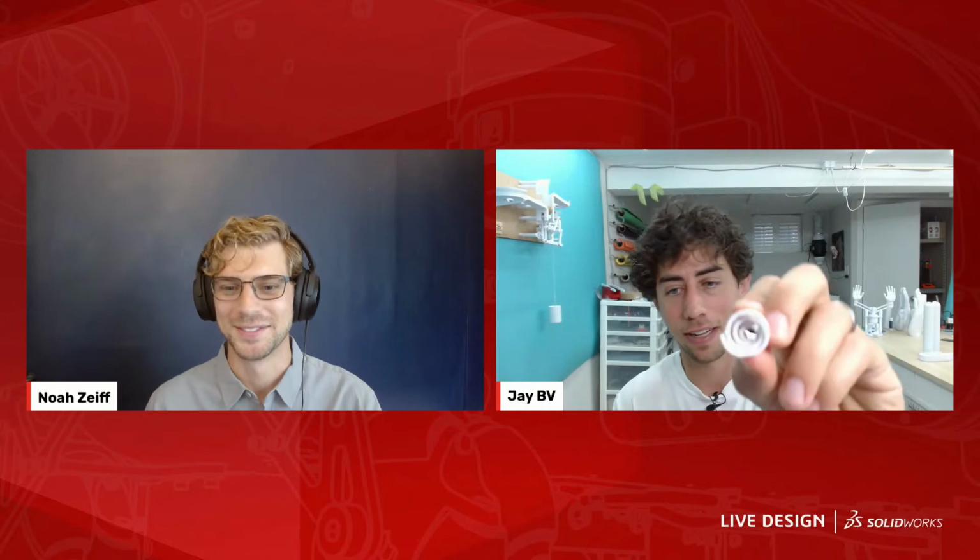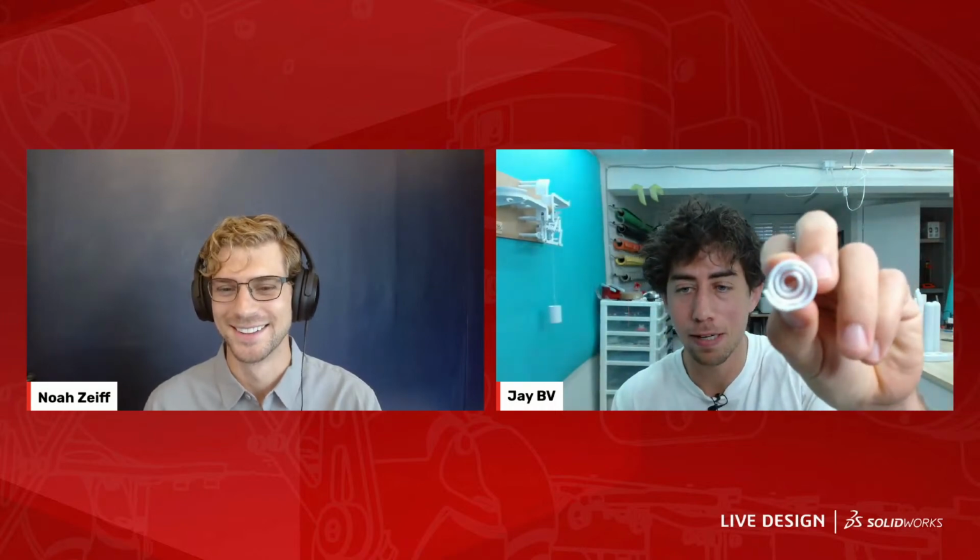You can see there's a little bit of that droop that we were talking about. Yeah, there's some droopage, but it doesn't matter. It still works, and it's just one of those examples. If you think about the method of manufacturing while you're designing, you can actually do some pretty crazy things. This spring was the first time I thought to do a spring like this, and it works quite well. If I had printed this in PETG or ABS, it would actually maintain its shape, but because it's PLA, it doesn't. But that's a whole other thing.